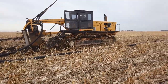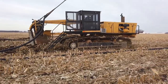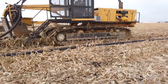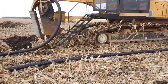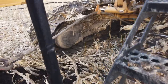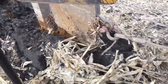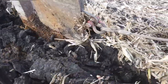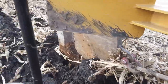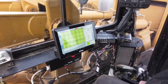Pete's going to pull this 4-inch perforated pipe in. Another thing I like is it has multiple points of adjustment to handle the grade so we can keep a good slope going, because of course you want the water to be going downhill. When he gets way off of that, you'll see up in the cab he's got a screen. There's also a dial gauge mounted to the cab, and this is all mapped out ahead of time. That screen is telling him what he wants the grade to be from the beginning of the run to the end of the run to keep enough drainage coefficient going.